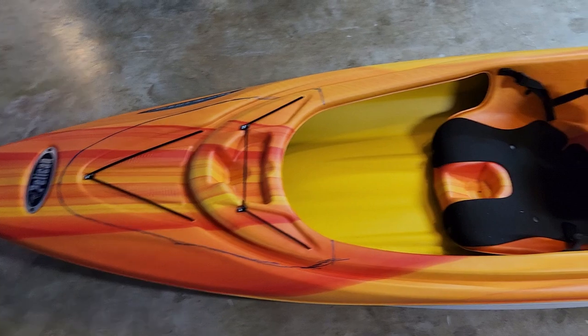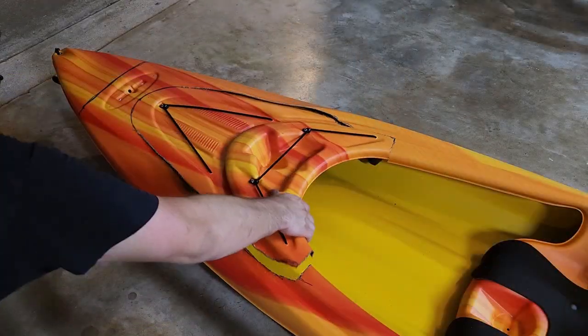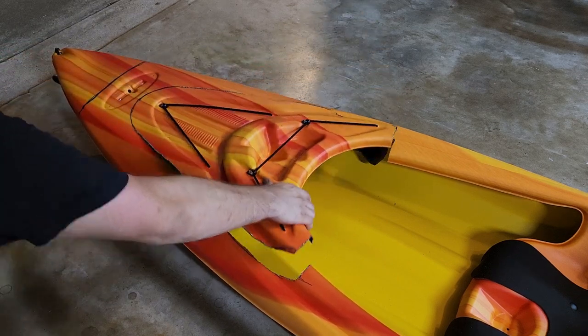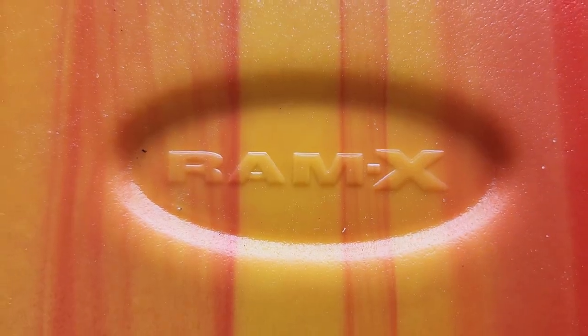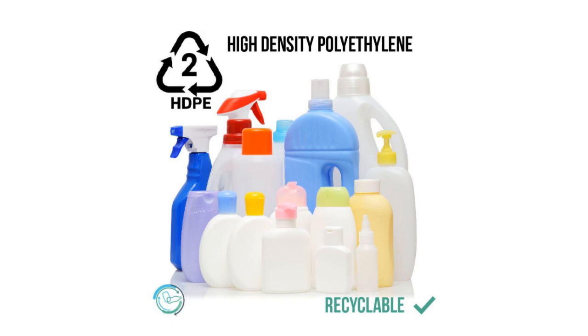I got a Pelican 100 kayak because it was pretty cheap and had approximately the right shape. The first change I made was to cut a flap on the front end so that it could be raised up and have sidewalls fiberglassed on later. This would be necessary to accommodate the bulky scuba tank I was going to use. The kayak is made out of something called Ram-X.